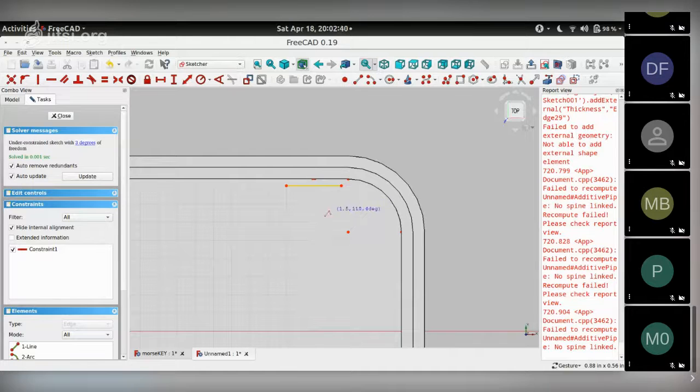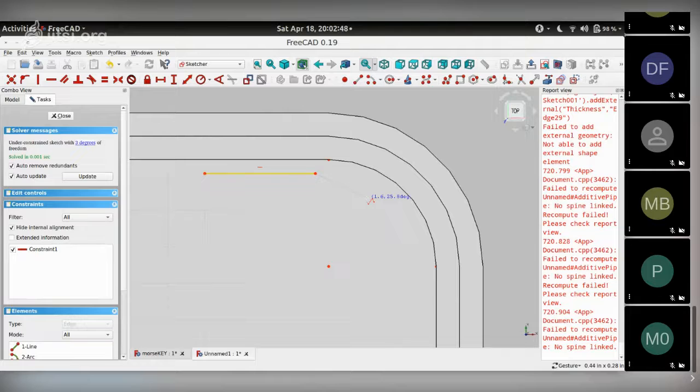That's what it does as the first step. And I can continue drawing straight lines, or on the keyboard, if I press the M key, I can cycle through various options, like pressing M once lets me create a 90-degree line corresponding to the earlier line that was already made in either the X direction or the Y direction. If I press the M key for the third time, I can draw an arc. And there are several options for drawing arcs. If you keep pressing the M key, it will cycle through all of them. That's an outside arc. The earlier one was an inside arc, an inverted inside arc, and back to a line and so on.